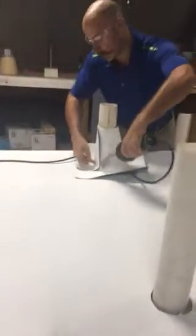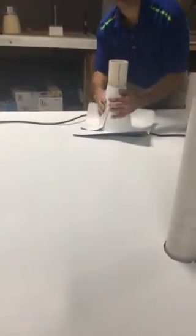Now, first thing I want to do is this vertical, because I want to be able to move it around. If I can move it around, that means I can push it up against this pipe and use the pipe as a solid surface to apply pressure. If I weld this in place first, now, you know, I don't have something solid. So, push it up to the pipe, you know, 2-pass weld, right, just like normal. Now, this is all done.